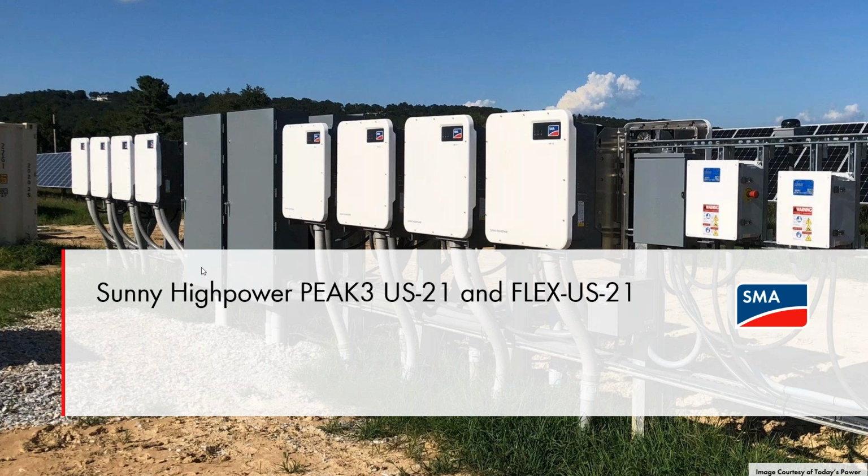So this is the latest in a wave of updates of having grid interactive inverters be able to provide grid support functionalities. Again, it's a testing procedure to make sure the inverters support the functions, whether or not they're turned on. So you're still going to have potentially different jurisdictions, different states, different territories requiring different things, but the testing process, the UL 1741 SB listing, is simply verifying that the inverters can support these different functionalities, and it's up to the AHJ to determine which need to be turned on during commissioning. So that's about as short an answer as I can give. It probably doesn't answer the question, but.